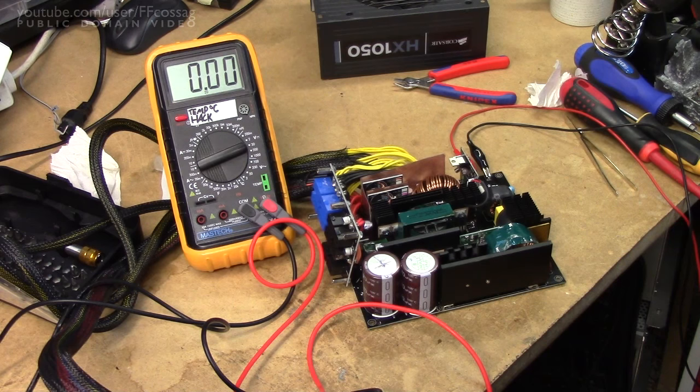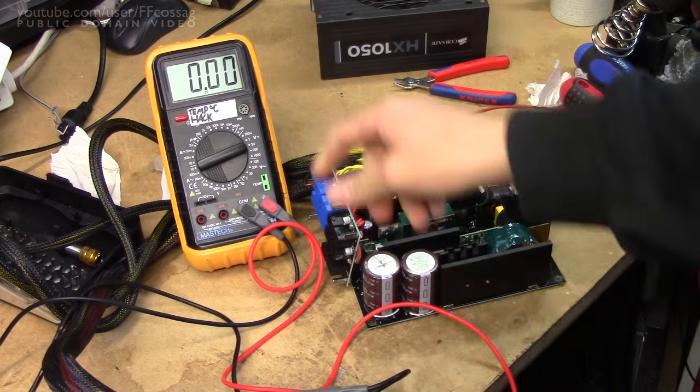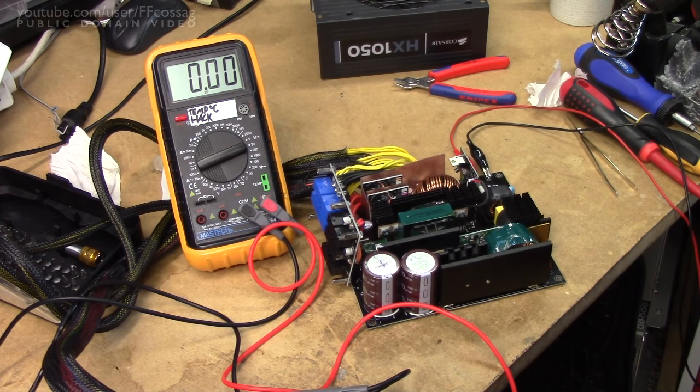I've connected up a little test jig now. We're monitoring the 5V standby on this meter here, and I've got the main input connected after my lab power supply, where we should be getting 150V when I flick the switch. We're currently limited to 150mA, so it shouldn't explode too loudly, but it could still go up in smoke. Let's just find out. Would you look at that — we've got standby voltage. It very nicely ramped up at the current limit and it seems to have turned on.